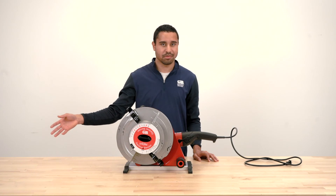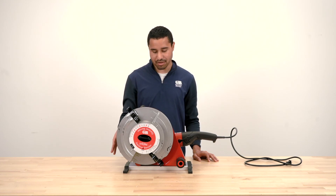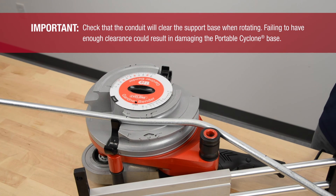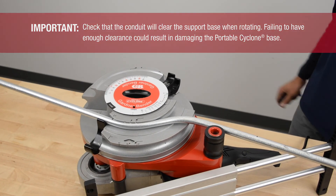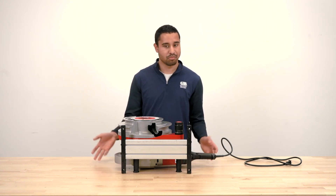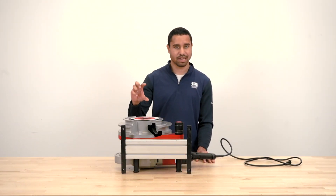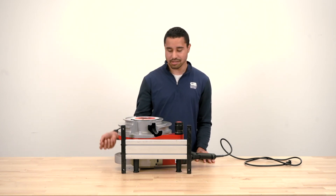If you don't have the end of a table to bend against, or you just prefer bending horizontally, you can do that with this bender. There are three legs on the back made from three-quarter-inch conduit — you can also put your own legs on to extend or shorten them as needed. Lay the bender on its side to do horizontal bends, and it works the same way as vertical bending. If the threader slides off the 11R or 12R adapter slightly, it may be because the adapter isn't set close enough or far enough from the bender — just unscrew it and slide it to the correct position.